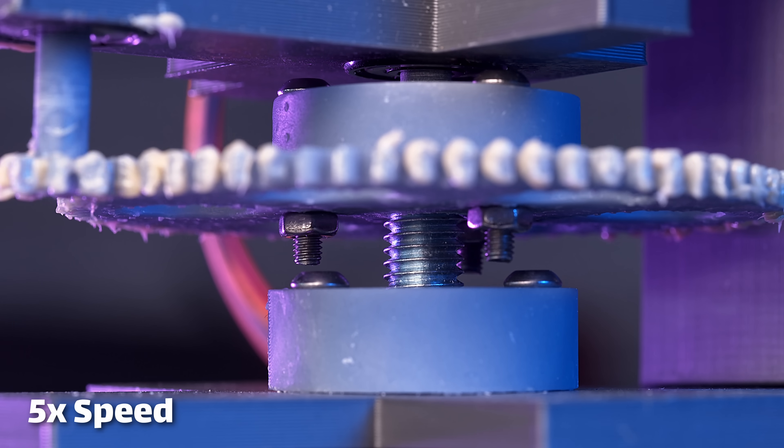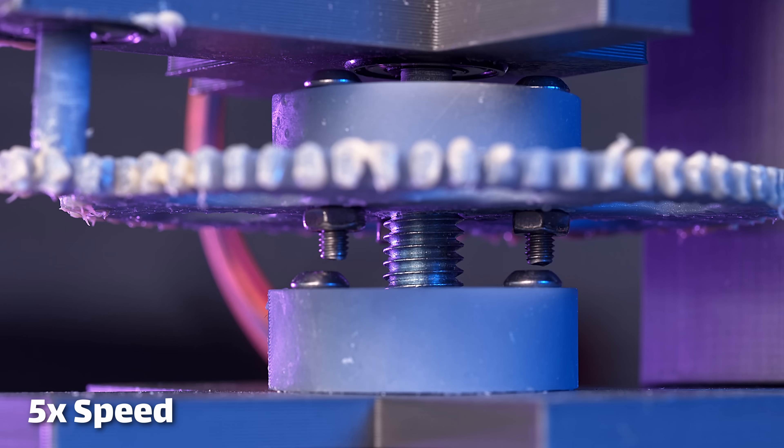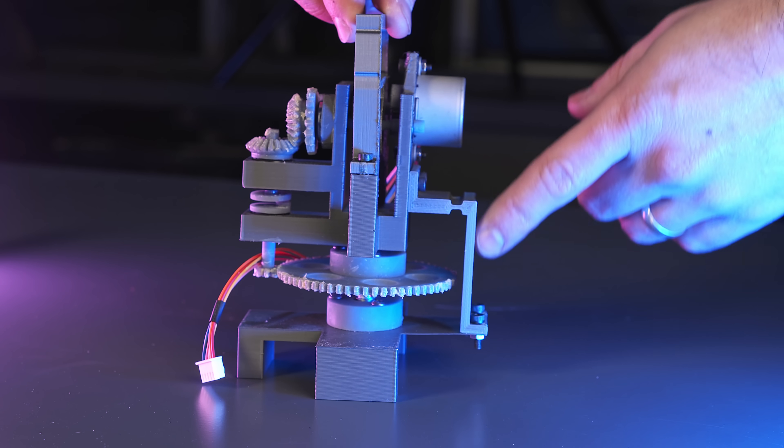The coarse stage has an additional 1-to-8 gear reduction, and the big gear is directly coupled to a ball screw, and that's what moves it up and down. Finally, the last important thing is this brace at the back of the actuator — this is a torsional stabilizer.